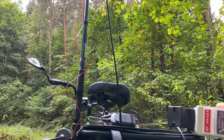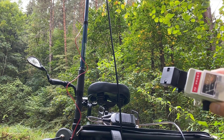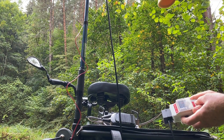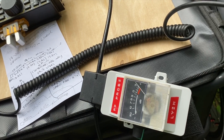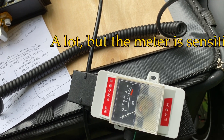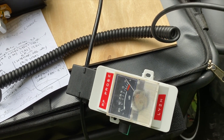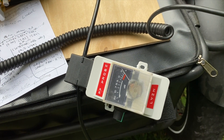Let's go. I'm on 40 meters now. I've switched my radio into FM mode on a free frequency. I clamp my meter onto the cable not far away from the radio, basically at the radio. We see that it's full scale to the right — it means a lot. It's a lot of RF feedback onto the cable and on the radio. I'm transmitting five watts only now. Even if the radio doesn't behave strangely because of this RF, it's no good.